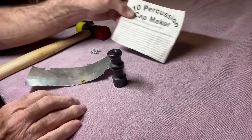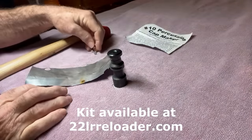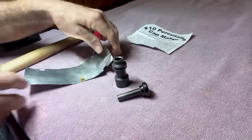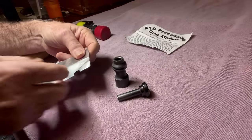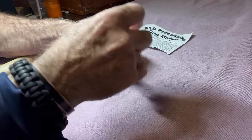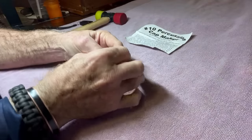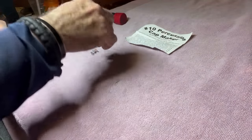What I have before you is the number 10 percussion cap making kit. I've already stamped out a couple and I'm going to make a few of these. Let me show you how simple it is. All you need is the press. You cut down a natural light can into some strips that you can manage. You want to not pinch your fingers. There's a slit right there - you take it and slide it all the way into the top, into the back. You slide the part with the teeth on it right in there, take your hammer, tap it a couple of times, bring it out. And then the cap is up in here - you just turn it over and there comes the cap.